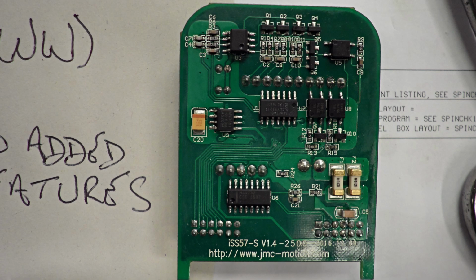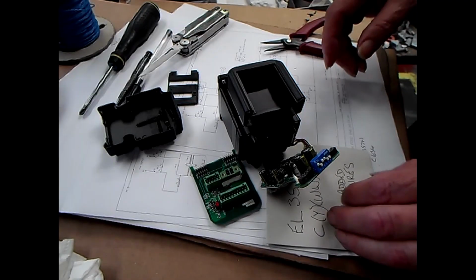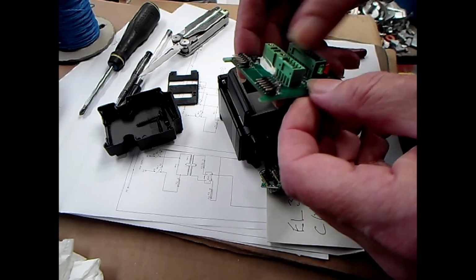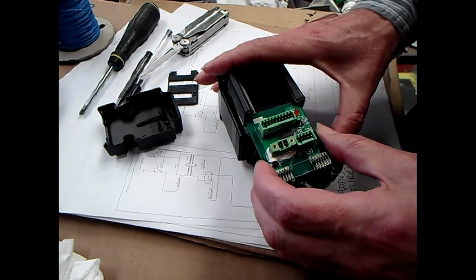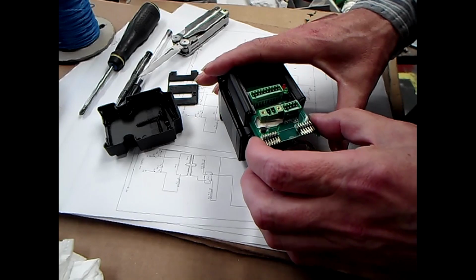Next line, T1M6, which means select tool 1 and change tool. There's no delay for this because there's no automatic tool changer or anything in it. It just runs through that instruction and then accepts that that's the tool it's got. Next line, S8000, which is ignored because it's the speed of the spindle, and that doesn't get set in this. That gets set manually at the spindle.